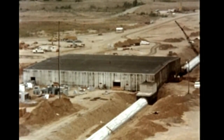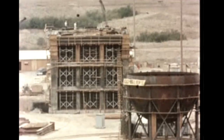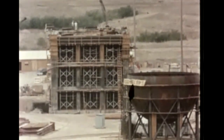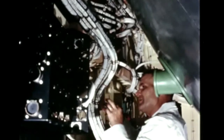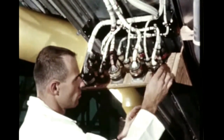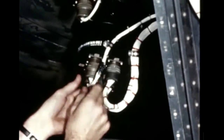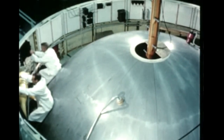The Beta complex blockhouse was virtually completed during the quarter. At Beta-3, the all-systems test stand, work on the superstructure and propellant storage tanks continued. Activity at the Douglas S-4B mock-up area at Santa Monica included electrical component installation in the aft thrust structure, work on electrical paneling in the aft skirt, installation of the customer connect panels, DAC's mating area to the J-2 engine, work on the instrumentation probe, work on the liquid oxygen probe, and instrumentation wiring of the forward dome.